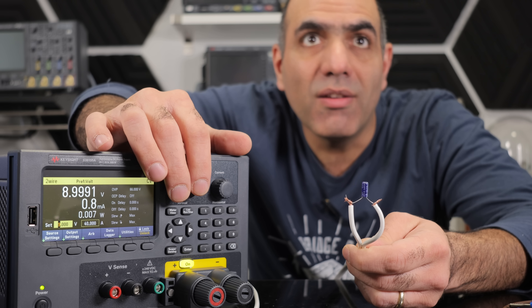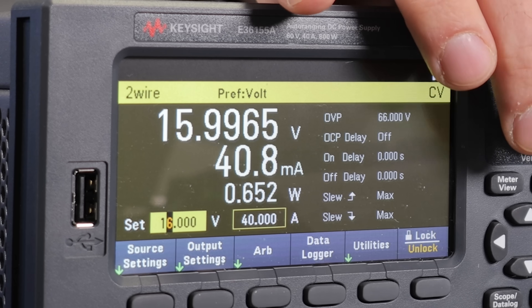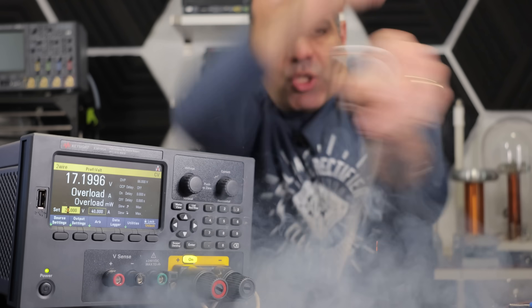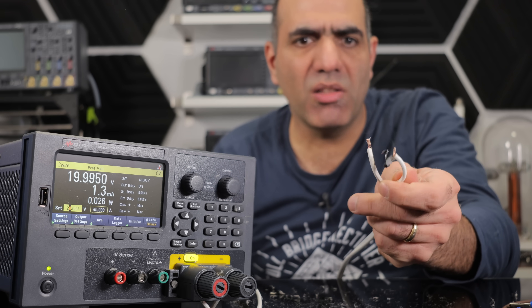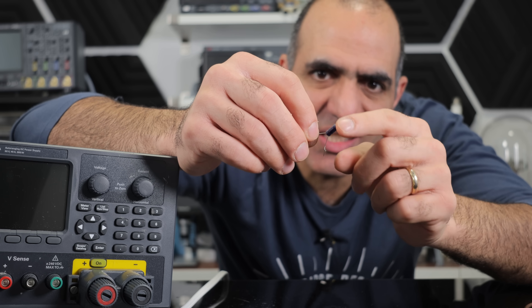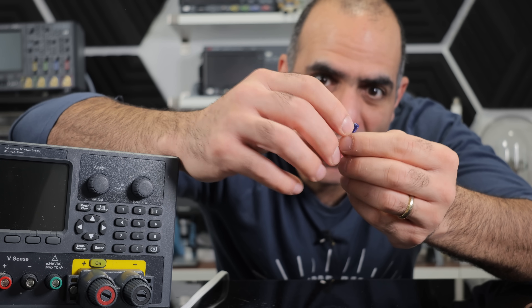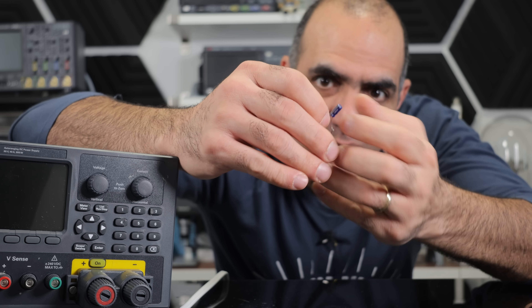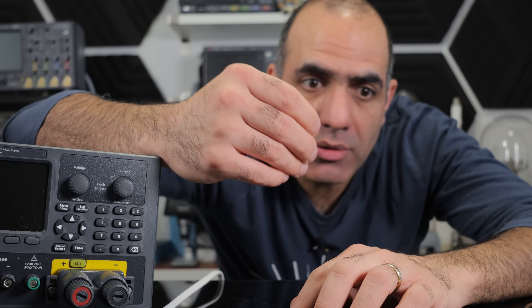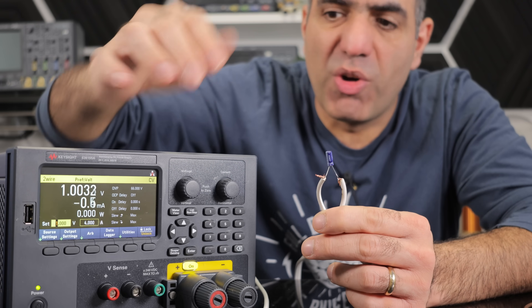You see? There you go — it's starting to conduct. It's almost one watt through the capacitor. I didn't even see it bulging. I guess it's like a pressure cooker. The dielectric gel in these electrolytic capacitors boils and the pressure builds up until it blows up. I just want to half break a capacitor; I guess I have to let it cook slowly.